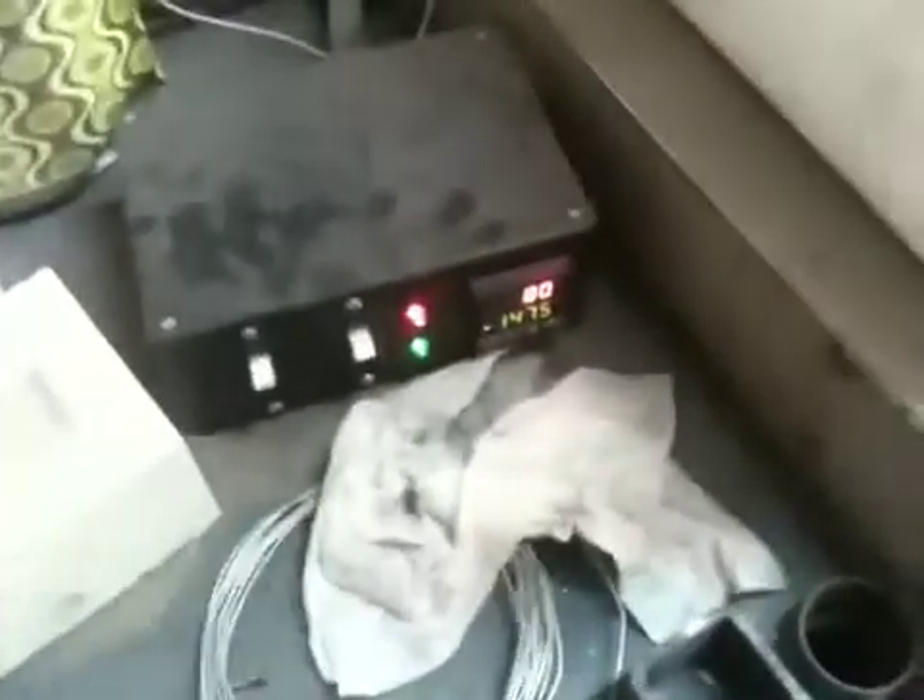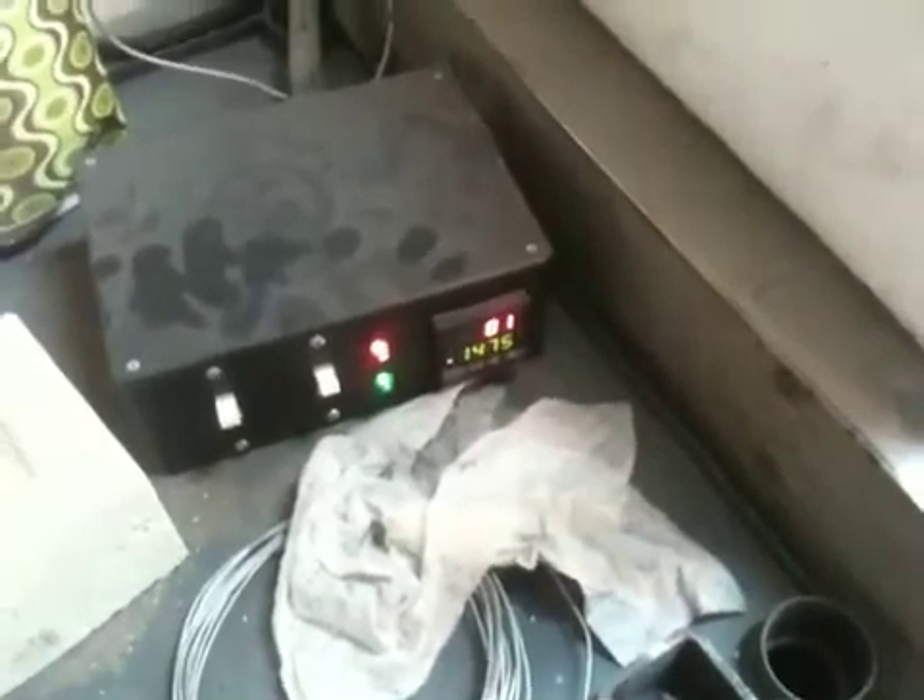It's the green light — we'll go ahead and fire this up and show you that. I did have it on for a couple seconds earlier, so as you can see, it is currently at 79 degrees. It's set for 1475, which is what I heat treat my 1095 steel at. As far as the wires you see, we just have some 14 gauge — I should probably change that to 12 gauge to give it a little more room, but that is sufficient for the current draw.